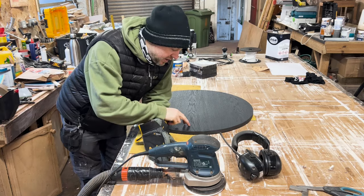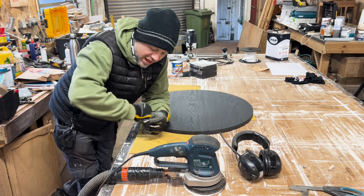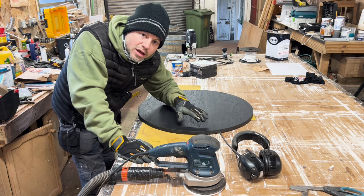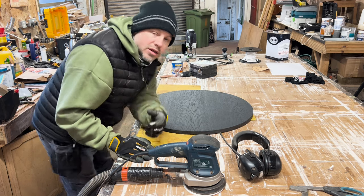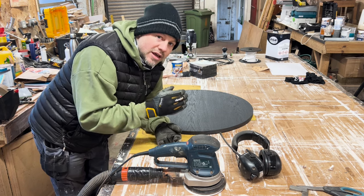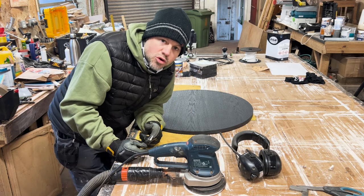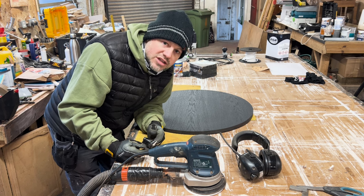So I painted these black and I'm going to sand most of the black paint off. The idea is that the black paint will be left in the grain and some of it on the surface, just like the surface of the whiskey barrels, so that I can match that aged look to the barrels. It's a technique that we've used in antique restoration jobs.